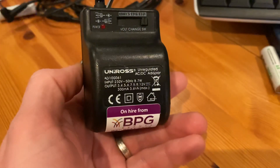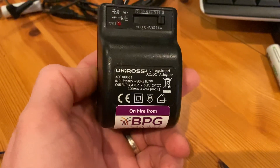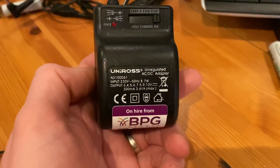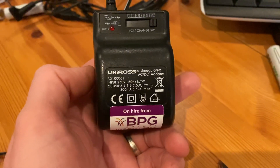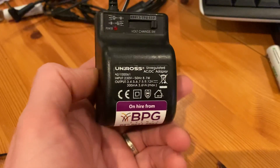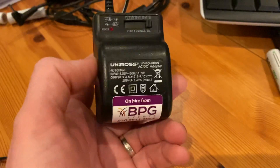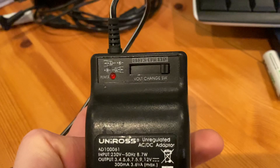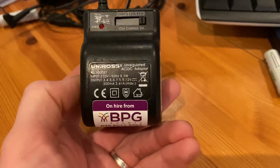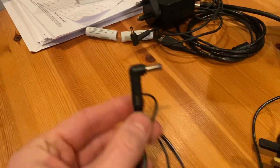You will see these every day when you're going around PAT testing. You might see them for telephone chargers or home telephone chargers. You'll see them for stereos, and a whole raft of things, even computer monitors. LG computer monitors use these AC/DC adapters. This particular one is a variable voltage DC adapter, but that doesn't really change anything. On the end of this particular one is a DC jack, and again they come in various sizes.